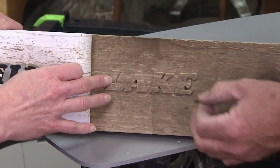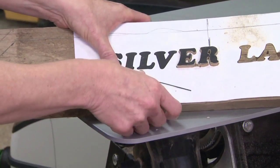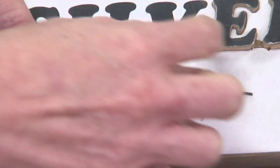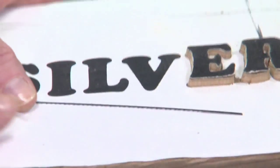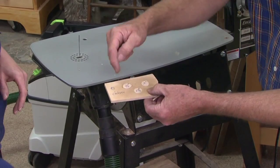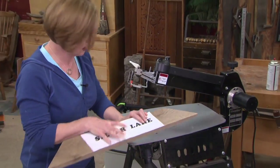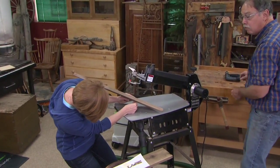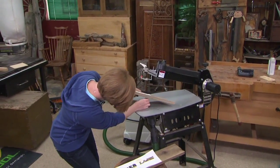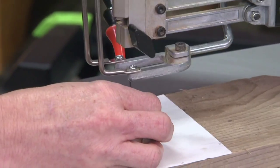Tilting the table or blade at a four-and-a-half degree angle is what makes the letters pop out this way, and you also have to cut in a clockwise motion. You can see the effect — the letter is raised and it's going to look really cool on that frame. It really gives it that 3D effect. We can sand the letters down lightly and that will make them stand out even more. I use a number seven blade — it's tiny but gets a great cut with about ten-and-a-half teeth per inch. It's a great idea to do a practice piece to see exactly how much that piece will pop out when you cut clockwise. That's how we figured out four-and-a-half degrees was perfect. I'm ready to cut — I'll pierce the blade through this hole that Scott drilled for me.